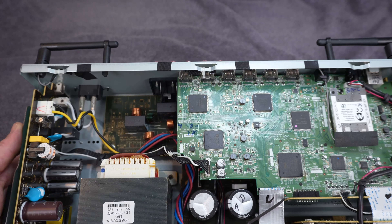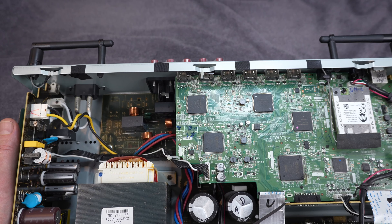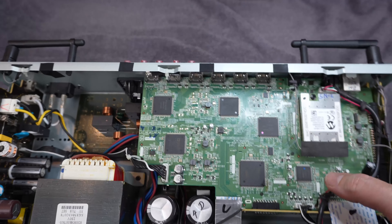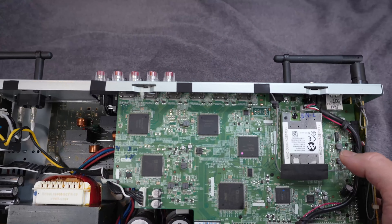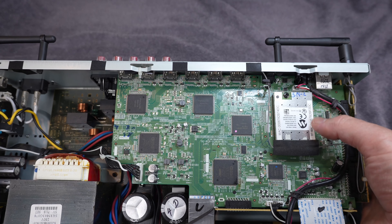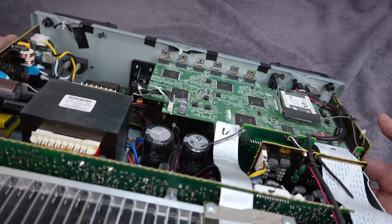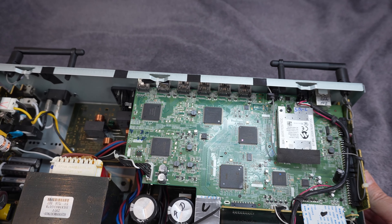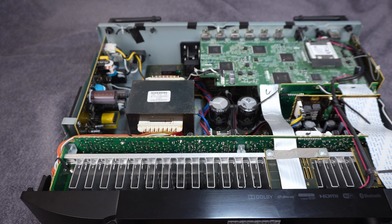So what I'm most interested in is down there. Obviously these are all of the transistors that make the noise. And they're actually electrically connected to this circuit board here. Can you see what I can see? This circuit board has got a wave in it, just the way that it's mounted. There's a great big wave along the length of that circuit board. So this is your drive board and they're mounted there - the legs have been bent in a U and then they're mounted to this heatsink. So this is all your power heatsink here. This bottom board down here I'd say is some sort of an analog board, because your speaker outs are on that and it looks like the line ins are as well.